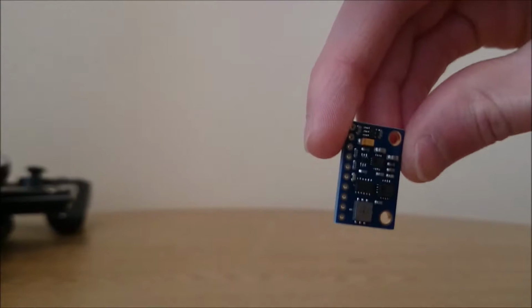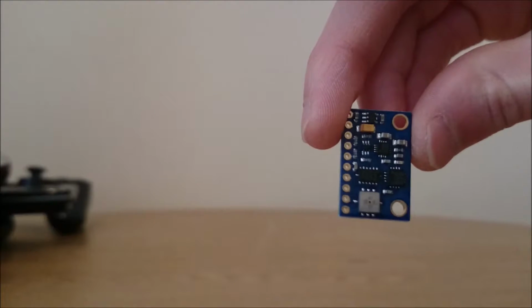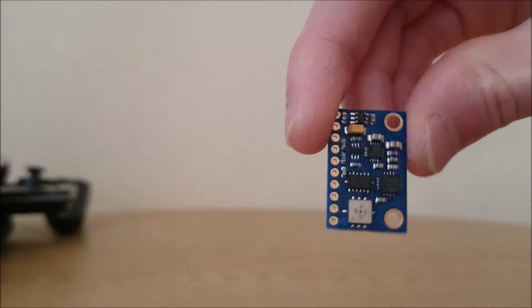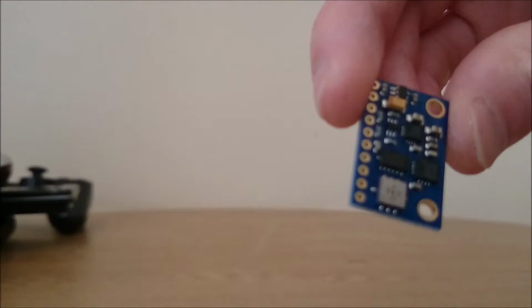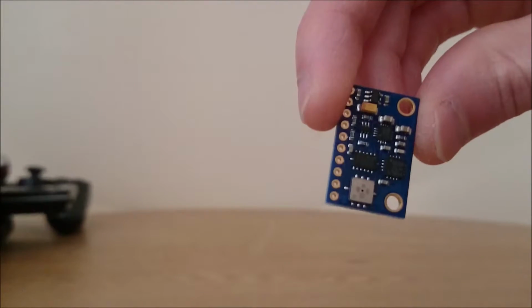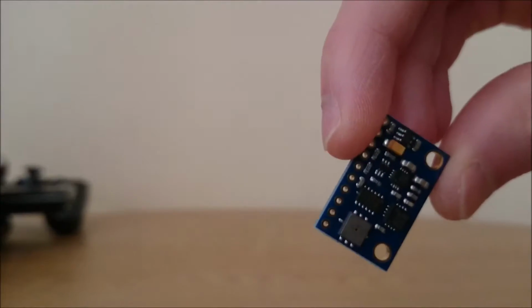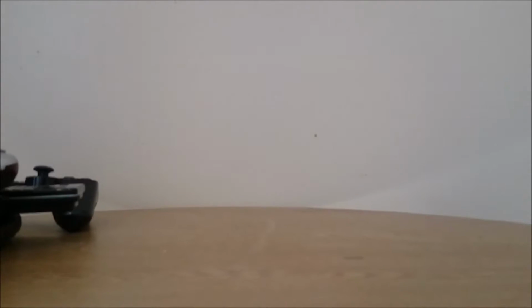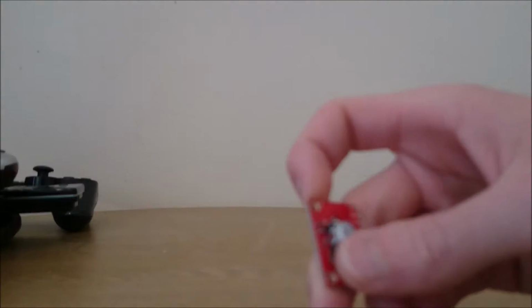This is slightly less low power, but this is a 9-axis IMU, so it has magnetometers and compasses, that sort of thing, and gyroscopes. So maybe this could be on the board, turned off most of the time, but turned on when it's needed. And then you could do funky things, maybe like change what macros are on display based on which direction you're pointing. So if you point the remote towards your stereo, it can show up your stereo functions. That would be quite cool.